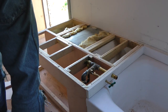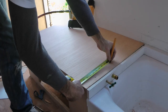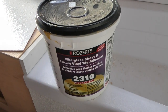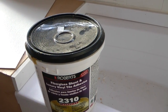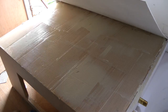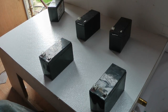I've laid down lots of adhesive. It's curious that the more glue I use, the greater the chance is that I'll have to take this apart later. Let's see if I can beat the odds this time. Next, I need to glue this plastic panel to the plywood. To attach it, I'm using Robert's 2310 fiberglass sheet and luxury vinyl tile adhesive — I'm using this because I had it on hand, left over from my flooring, and I don't want it to go to waste. This costs almost $30 a bucket. To spread out the glue, I'm using a 1/16th inch notched trowel. Now that I have a nice even coat, I can put the panel to the sticky. I never knew how useful discarded backup power supply batteries could be. Now we'll let that rest and check back later.